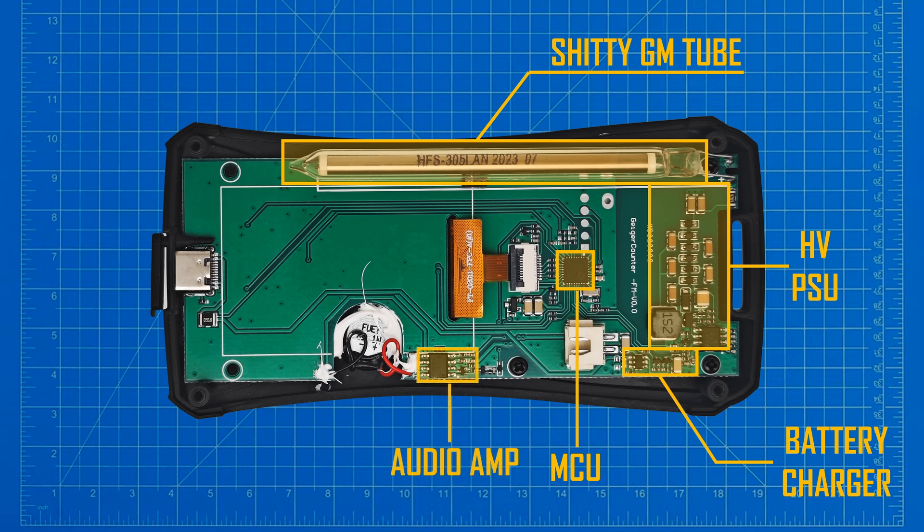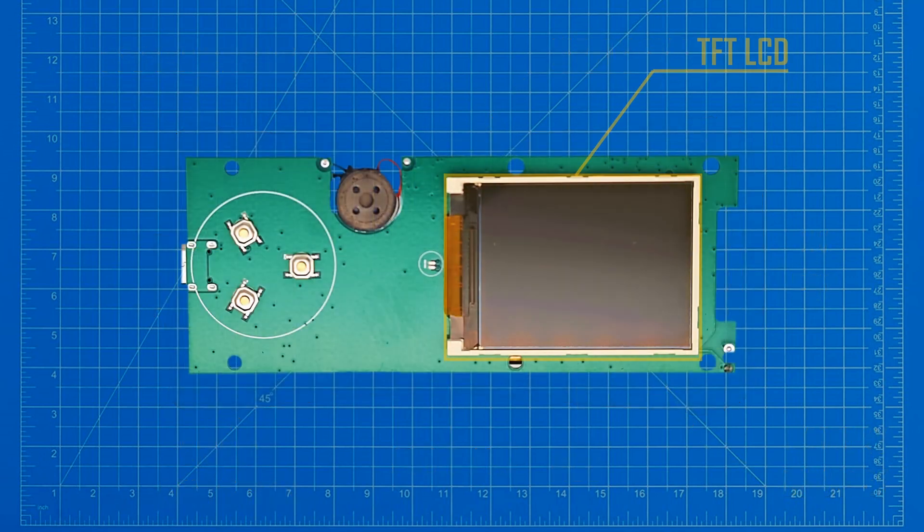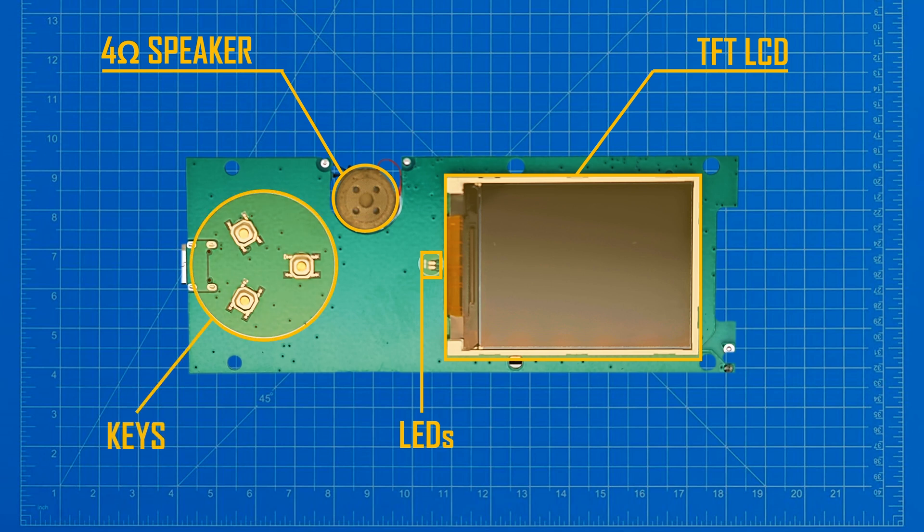Here is an audio amplifier. Unlike other devices that I have reviewed, this product does not use a simple piezo sounder — it uses a fully-fledged miniature speaker driver, and as such it also requires a real amplifier that is capable of driving it. Here is the connector and flexi for the LCD. And finally, there is the USB connector. This only provides power to the product — the data pins are not connected, so it cannot even be used for firmware upgrades. Looking at the back of the board, we can see the TFT display. The LEDs are also on the back of the board, along with the speaker driver and the three keys.